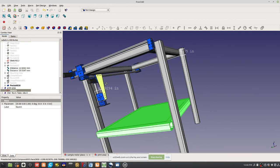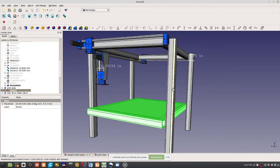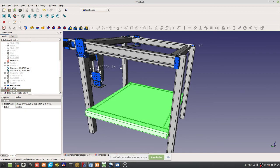Oh, okay. So I'll try heating it, because the heat does work. I tested that for the heating block. The halogen lights work as well, so I'll try heating it, and then I'll try moving it after. You need to have heat before you can start moving the stepper motor on the extruder. It's called cold extrusion. You can't extrude cold, because then you're just pressing against something that won't move. So the default is disabled. Is there an enable cold extrusion within the LCD menu? I don't think so. You have to do that through a wired connection.